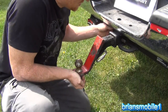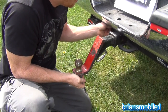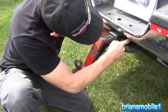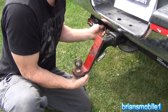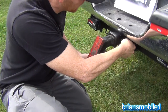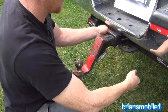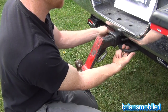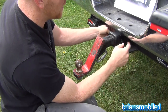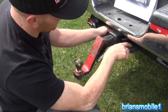You want to make sure that the pin goes in and that the clip goes in. Usually what I like to do is angle the back side of the pin up this way so that it gets in past this little shelf — I'll show you on the other side what that looks like. I just like to have it back in here so it leaves room for the chains. If it's here then it's hard to get the chains in and they interfere, so I always put mine in like that.